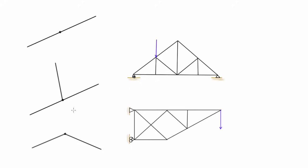When analyzing for zero force members, we do it joint by joint. If there is an external force applied at a joint, we can no longer just say by inspection that a member is a zero force member. The applied force introduces a force component both in the plane of the two collinear members and perpendicular to that, so the non-collinear member would actually need to carry some force. When you see an applied force at a joint, you can't immediately declare things to be zero force members at that joint using these three definitions.